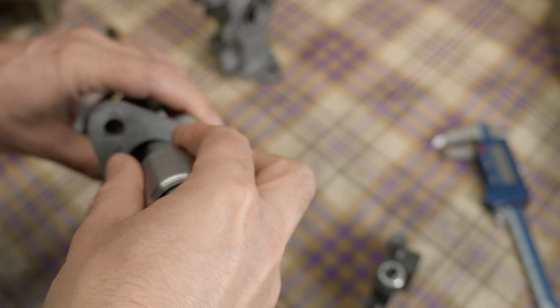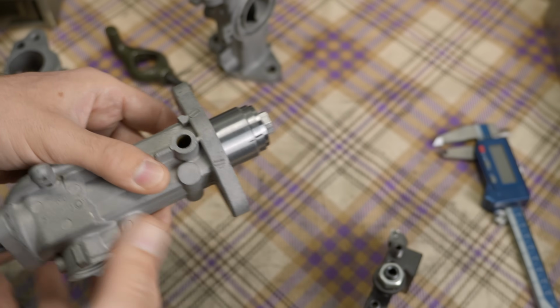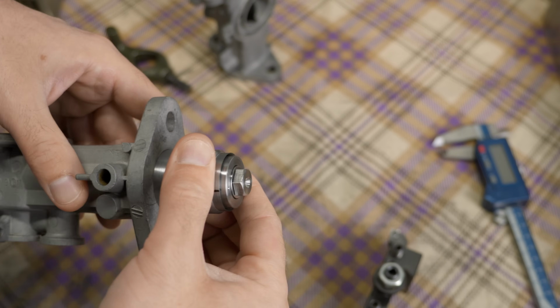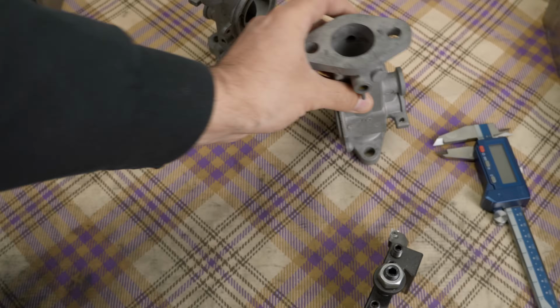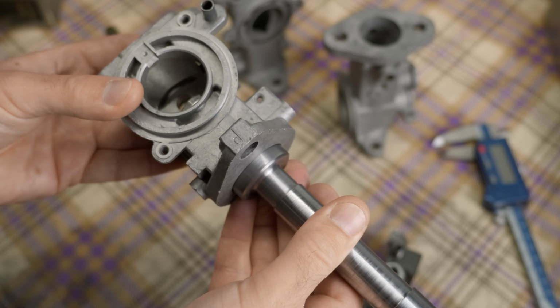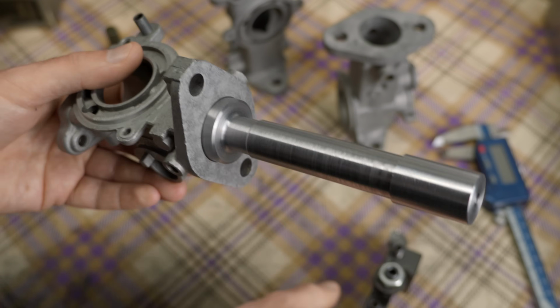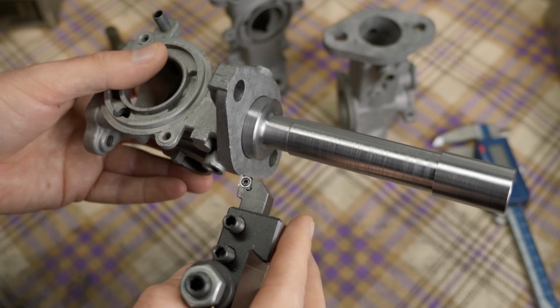And I just realized I missed something. I've been checking the tool's progress against the H2 body and I miscalculated the length of the head. It will work fine for both H2s, but the problem is the HS2. Remember when I said HS2s are shorter? Basically, I made the head too long and didn't leave enough clearance to finish the cut without touching the mandrel.